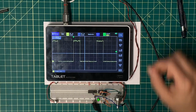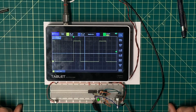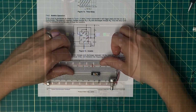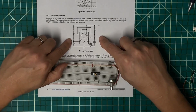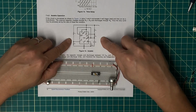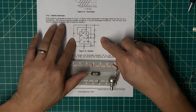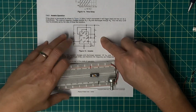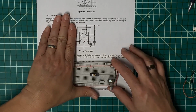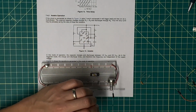All right, let me go build out a traditional astable circuit. I'll find a diagram of that too. Okay, here's to hoping third time is the charm. So this is a traditional astable timer circuit. The load is over here tied either between the output pin and 5 volts or the output pin and ground. So we can ignore that portion of it for now.